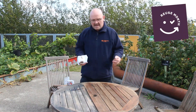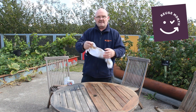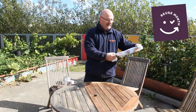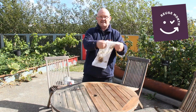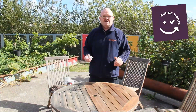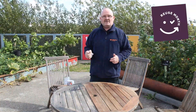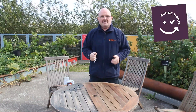If it's a deal table I would suggest painting it — it would look better than an oil finish. When you're finished with your oil rags after applying them, don't roll them up in a ball and throw them in the corner. Leave them out nice and flat over a fence or similar and let them dry that way. If you're using Danish oil this is particularly important, because if you ball them up there's a combustion risk with oils. Just leave it nice and flat over the back of a chair. There you go — you've got yourself a brand new table. Now you can sit out and have a nice cup of coffee in the mornings, listen to nature, enjoy it. Thank you very much for joining us — that's your homework for Reuse Month. Get your garden furniture sorted, you'll have it for many years. For top tips go to myways.ie.